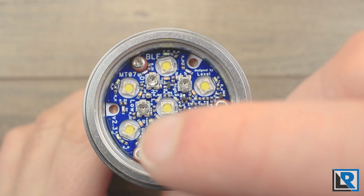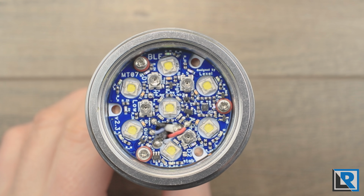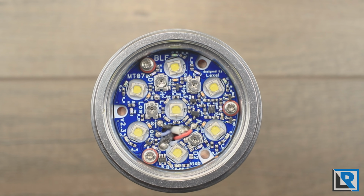These are very small LEDs in there, and they don't put out very much light, which is a little unfortunate because I like that effect. But you can also see these three pots in here. Here, here, and here. And those are used to adjust the overall brightness of those LEDs. You can't get them all to be super bright. You've got a current limit that everything's limited to, but it does give you some ability to adjust the secondaries, maybe if you only wanted blue or only green or whatever. So that's fun.